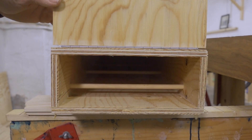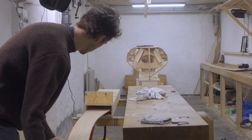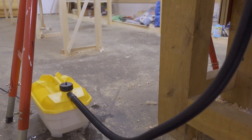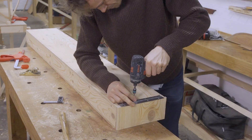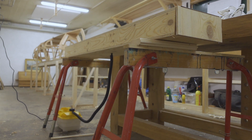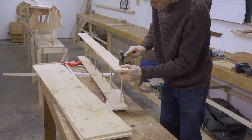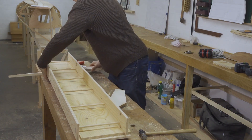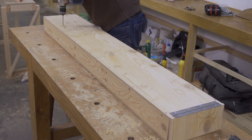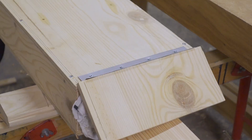Usually steam bending is done in a steam box. In this case it's a plywood box with some dowels through it. The dowels suspend the plank to ensure good circulation of the steam around it. The box has a hole at the bottom where the steam goes in. One end is closed, the other end has a hinged door. I'm using an electric wallpaper steamer to generate the steam but an old kettle with a rubber hose attached to the spout works fine too. The steam box is not airtight — in fact I want some steam to be able to get out, which will create circulation around the wood and help it heat up evenly. I've drilled a few holes along the top of the box to allow the steam to escape, and stuffed some rags around the plank at the hatch end to tighten it just a bit.